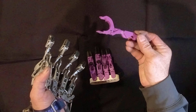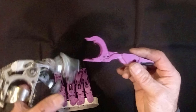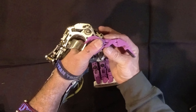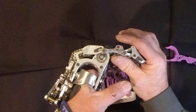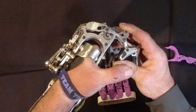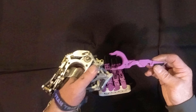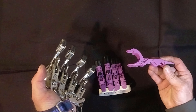But this is pretty encouraging. One of the things that's kind of a step backwards in the design is that unlike on this hand, when the proximal section of the finger stops, the motion of the rest of the finger also stops. Whereas on this design, when the proximal stops, the medial and distal are allowed to continue to travel. Design-wise it's kind of a step backwards, but if it allows me to get this project out to those that are in need of it, I'm willing to make that sacrifice.